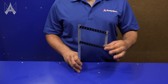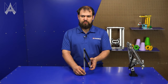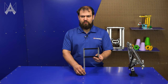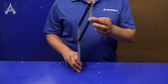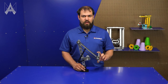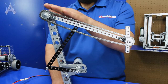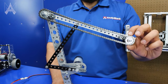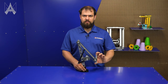This is a simple example of a four bar. The longer tube would be fixed to your robot, and the smaller tube represents the end of your arm. As you can see, there are four bars represented here, hence the name four bar. This type of arm allows the end effector to stay at a fixed angle to the ground. In this next example, we have what's called a virtual four bar, where the chain and sprockets make up the two black bars from the previous example. This still keeps the same angle to the ground.